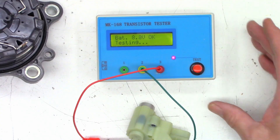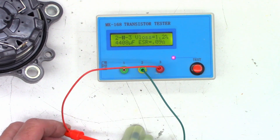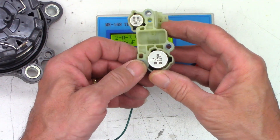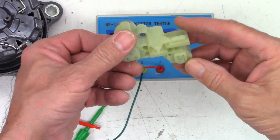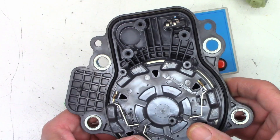We shall find out — 4,408 microfarad, ESR 0.09. That's not too bad. So the caps are good. I would imagine if you had one of these and you were trying to keep it going, you'd want to go ahead and replace both caps — the 100 and the 4,700 microfarad cap. But that's what's inside the magic box.